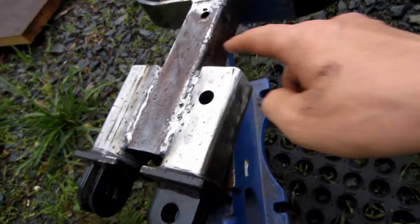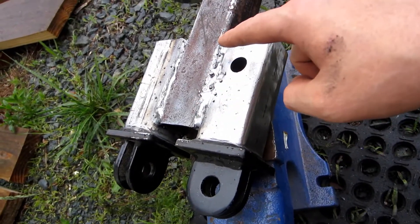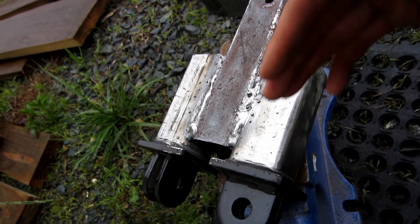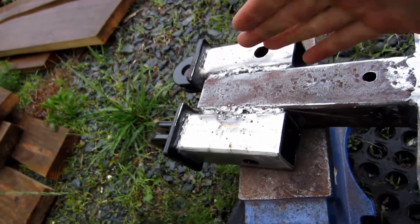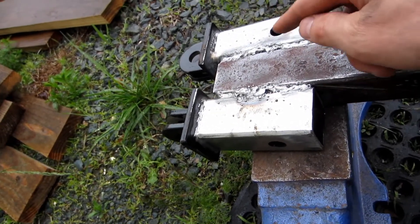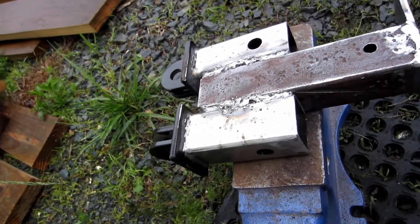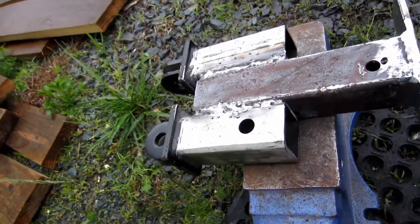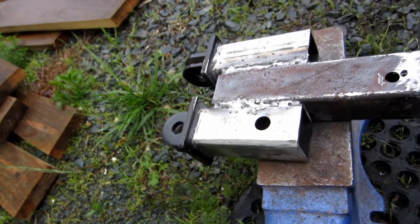Well, this is a terrible welding job. I kicked the amperage way up because I wanted to make sure it had really good penetration using 6013, and I felt it just kind of riding the surface. But what happened was I ended up making a few wormholes because the amperage was so high. I probably should have just kept it at a lower amperage and gone steady and slowed it down. So then I kind of skimmed the top and tried to build up a layer a little bit, make it a little less shitty. It just turned out really ugly, and I'm so sick right now — I should just stop while I'm ahead.